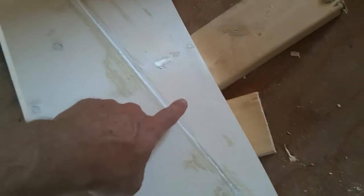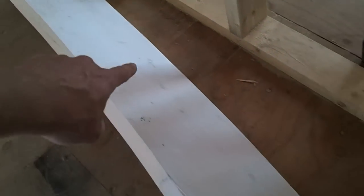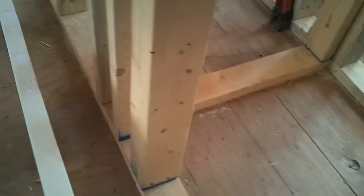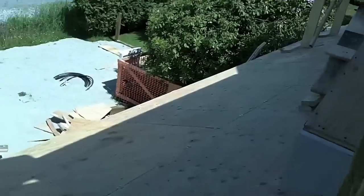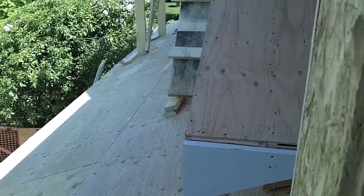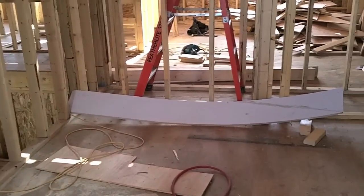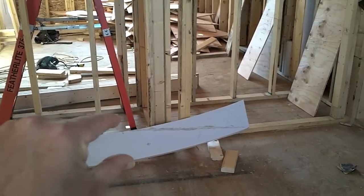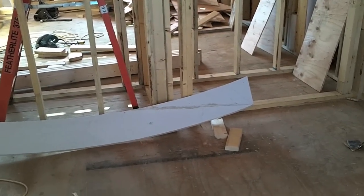On the back we've also put some pocket screws in there to hold the middle section together — seven three-inch screws holding these pieces together. This is a nice curved radius that we've sanded smooth, we'll need to do a plumb cut here using a level once it's actually up. Basically that's the back — this will be the front that we'll see from the street. Once that's painted it'll go right on top of our framing, the tail end will hang over, and it'll look great. Curved fascia — that's how we take straight wood and make it round without it looking wonky or kinked. You see so many of these that look like a hockey stick on one end, but that's the way we like to do it.